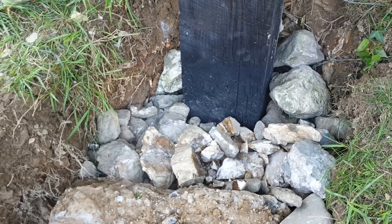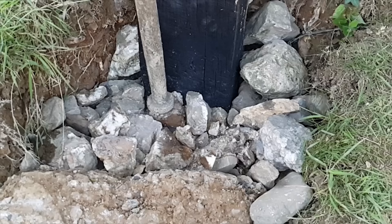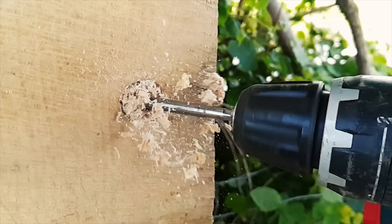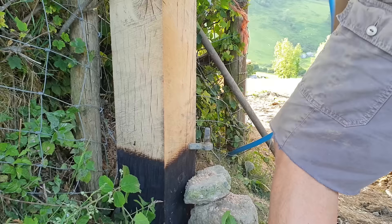This is how we're compacting the stones and ramming them into place. The idea is that you do a few inches of extra stone, ram that all home, do another layer, ram that down, do another layer, compact it back down — and that way by the time you get to the top you've got an absolutely rock-solid post. Here we're drilling for the top hook of the gate that will be under tension when it's mounted. It's quite something to drill such a big hole all the way through such a large post. The bottom hook is just rammed home and has to be very tight because it's under compression from the gate.